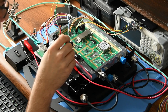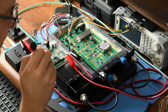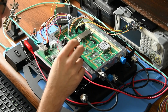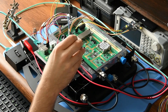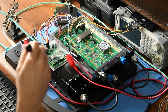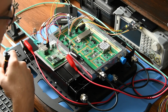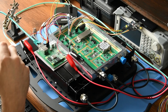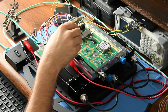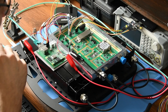Then we've got the receiver. It's directly connected to the antenna input or the RF input. Then we've got the automatic level control, which is used to stabilize the power output of the RF part. It directly drives the power amplifier, so you can set the power output from 1 watt to 50 watts continuous wave. As it's an envelope detector, it works best with constant envelope modulations like FM, M17 included, and AFSK. This big transistor right here is a MOSFET used to turn on the power amplifier when it's needed.